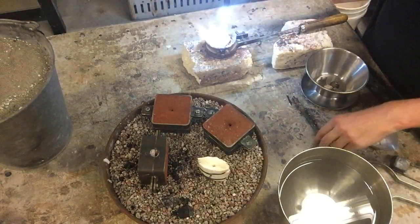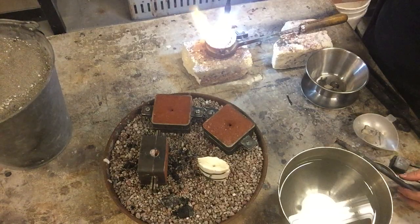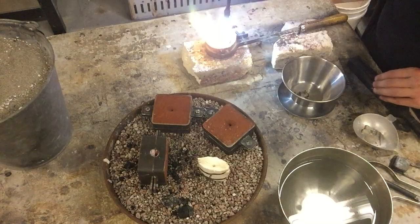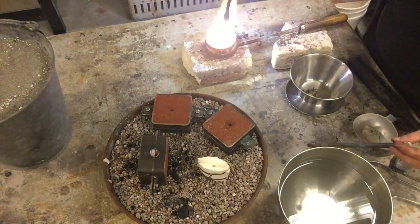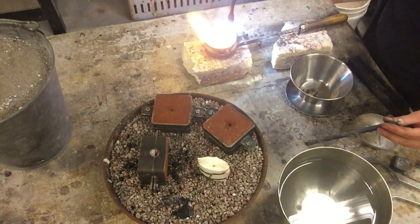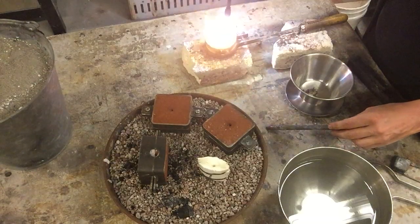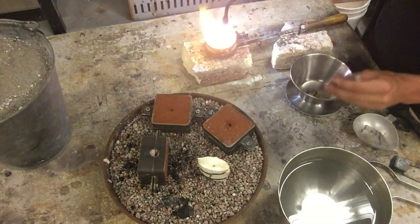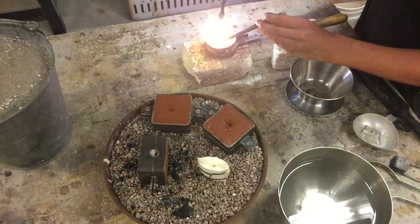Now we're alloying our fine silver with some copper washers. We're just below 7.5% for the copper weight, so we know it's going to remain sterling. The rest of what I have on hand is already alloyed as sterling silver. We're going to wait for the silver to melt — it's going to fully encapsulate the copper. We still need to stir it for a while while the metal itself alloys. What you don't want is a partial alloy where it looks like you have fine silver mixed with some shibuishi and your metal ends up looking like an orange creamsicle.